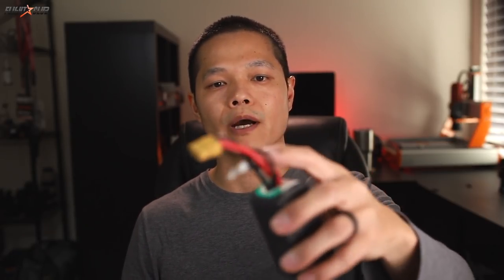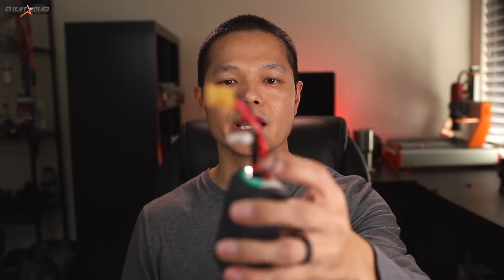Rule number three: carefully inspect all batteries after flights, before charging and storing. Look for puffing cells, punctures, dents, or any other physical damage. When I was doing the Bangkok torture video, one of the crashes broke my balance lead and the positive and negative wires were just dangling. When I got home and took the battery out of my bag, I got a huge spark and smoke because the lead shorted while I was moving the battery. Things could have gotten really bad if that had shorted while it was in my bag while I was driving.